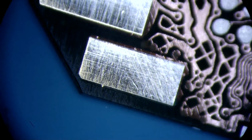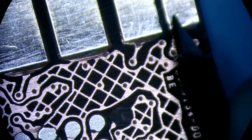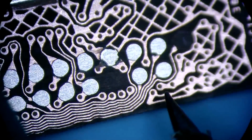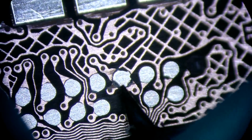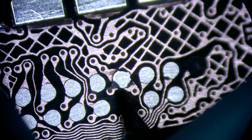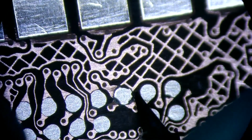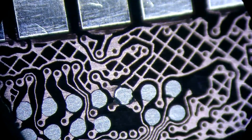And this is good. So we only have one pad on the interface that needs a little correction, and that one is right there. We're gonna run a tiny jumper from here to here, no biggie. But what I want to fix is these connections here. You see this pad connects to 4 via holes that are now split apart, and that's our ground. The ground goes here, here, and here, and it's all disconnected.